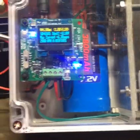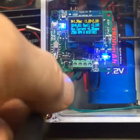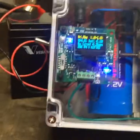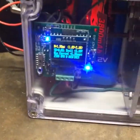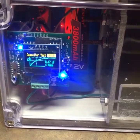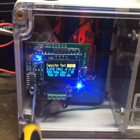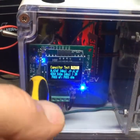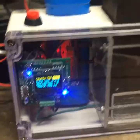There's also the capacitor test. In this case I didn't put another switch out here — I just have to flip the switch and open the contacts at the same time I do the test. It looks like it's a good capacitor; it's actually a new capacitor so it should be good. Also, if I wanted to I could change the speed of that multiple-fire test by just taking a screwdriver and turning that.